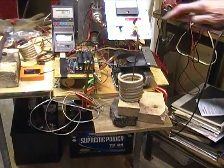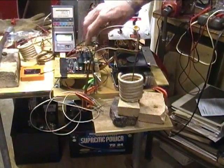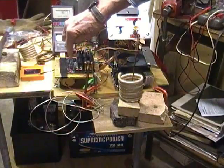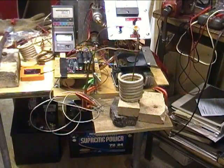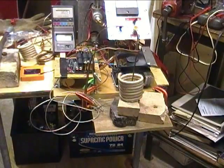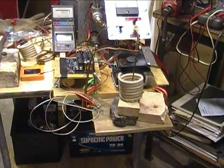One thing that's new is that I've added an extra whole bank of capacitors here from one of my early failures. So I'm down from 113 kilohertz to about 60 kilohertz.